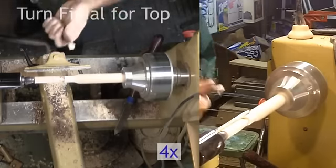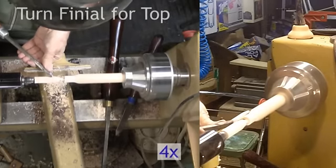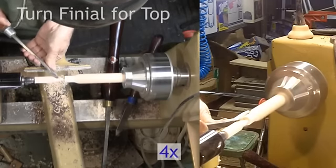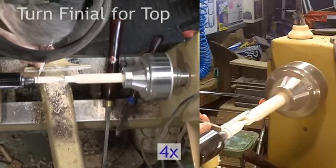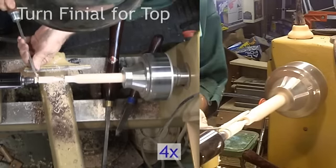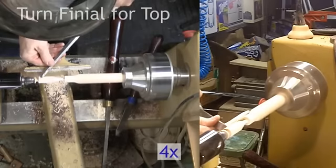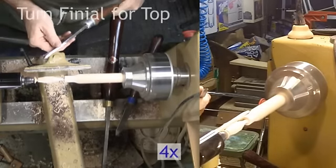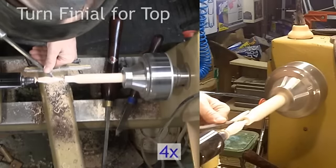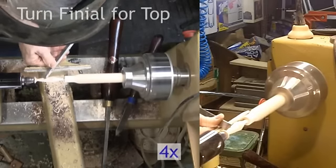So scrape a little, measure, there we got it, let's go for it. I wanted a very simple finial for this, essentially just flare out a little bit from the tenon and then flare basically down to the other end. On the top and the bottom, especially the bottom, I decided that it would need a little bit of a bulb. I didn't want a sharp point because I was afraid that my grandchildren would be playing with this, so I put a little ball end on the bottom finial. The top finial would have the hanger on it, so it's protected. Then the short side ones I left as being somewhat pointed, but certainly not a long, narrow, sharp point.